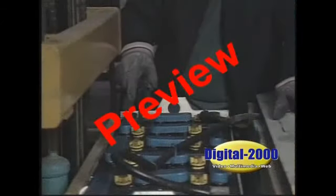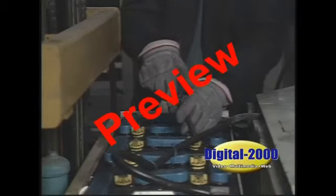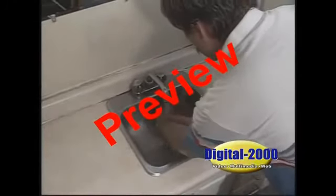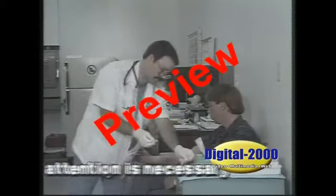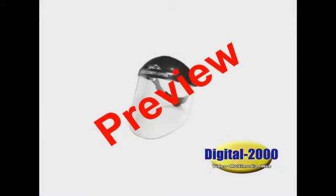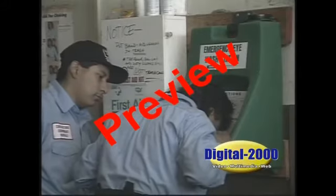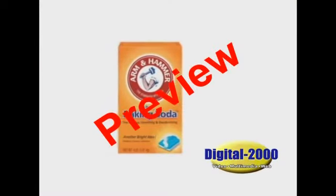Be prepared for an electrolyte spill and have adequate water available to flush your skin or other affected area with water. Volumes of water applied quickly and continuously will prevent serious injury to the skin. Quick medical attention is necessary to assure proper care and treatment. Splashes to the eyes can be avoided by wearing proper eye face protection. However, if electrolyte is splashed into the eyes, wash the eyes with water for 15 minutes and get immediate medical attention.